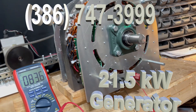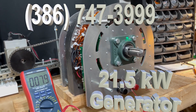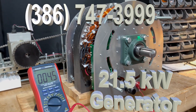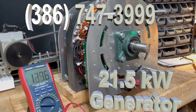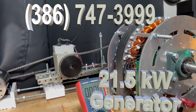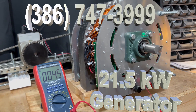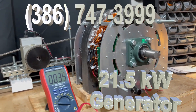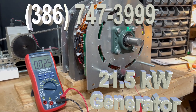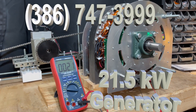The one thing people ask me is: what about it being under load? There's no difference between it being under load and not under load. The difference is the torque you apply to the generator. The generator will still produce the power. This is still producing the power regardless of the load, and we have a torque meter on it back there. We modify the torque and watch the voltage so we can tell you what the torque is going to be. The torque varies based on the load — if you put a 1-ohm resistor on it or a 50-ohm resistor, you've got a different load. But the way you change the power is by changing the torque.